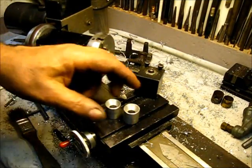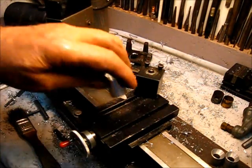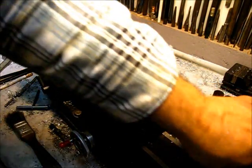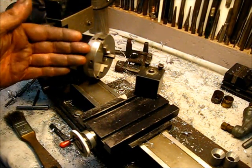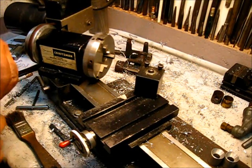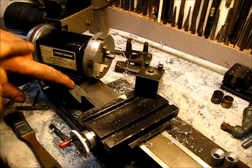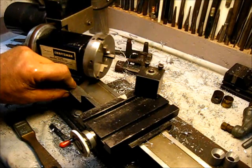Okay, we've got those two done. Let's recap — we'll do one more. What I did is loosened up the headstock, removed the alignment key in the headstock, twisted it around to the 30 degree mark on that scale right there. Then I put this angle right here against the bed and against the headstock, and confirmed that it lined up — and it does.